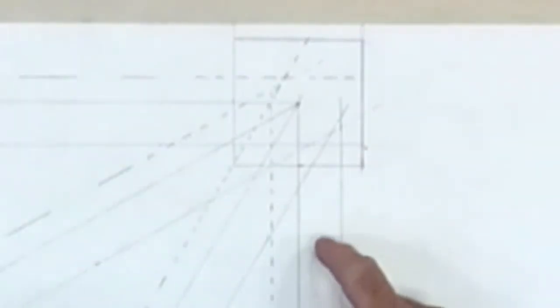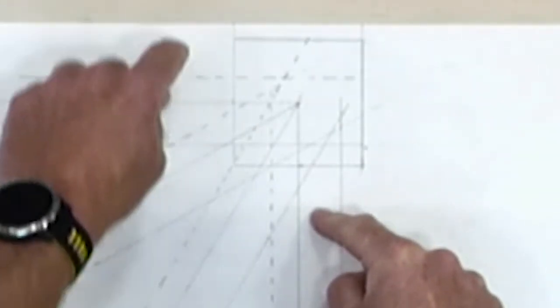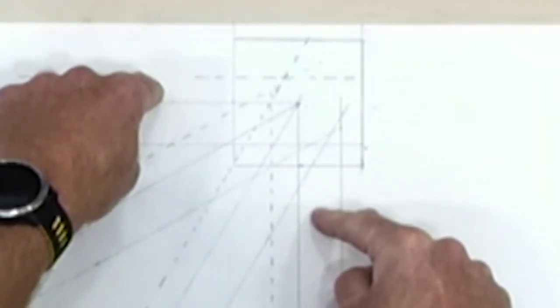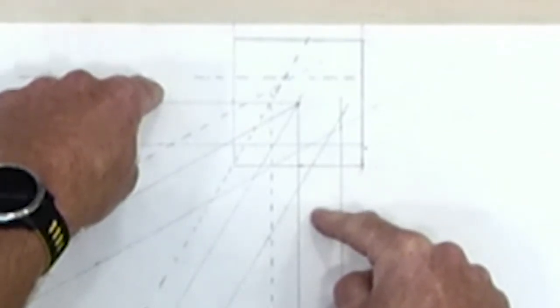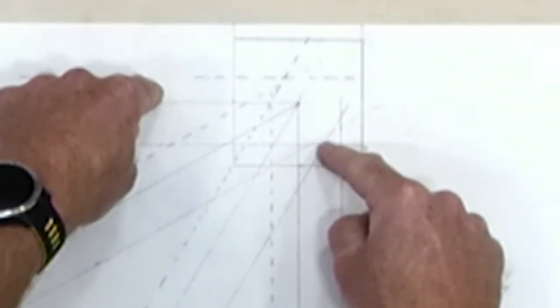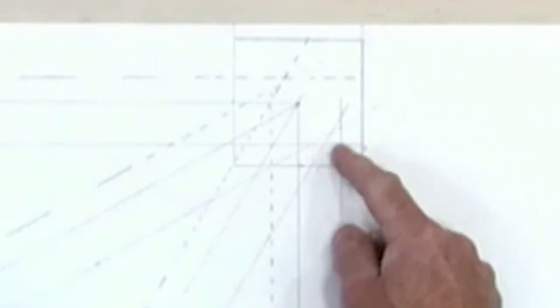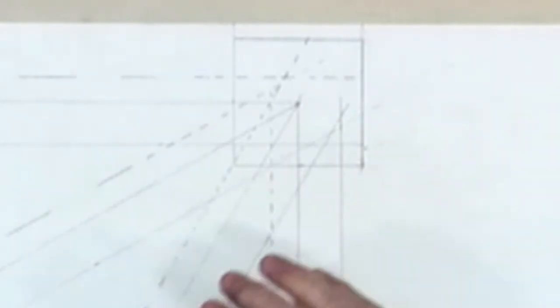What becomes challenging now is when we're in the shop, taking this and stretching these all out. If our rises were 7 inches, there's going to be 7 inches between this tread and this tread and this tread and this tread. So we have 4 different rises on here. That's going to take up 28 inches of newel post, and it turns around the corner here. But the location of each of those mortises on the newel post in plan is given to us right here. And all we need to know is where they line up vertically.